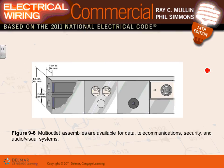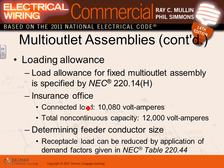If you don't know, always assume they're simultaneously used and give every 1 foot 180 volt-amps. Like I said, guys, separation is very important: separate the high voltage from the low voltage section in your multi-outlet assembly. Loading, we talked about the loading, guys. The loading is basically 180 volt-amps for multi-outlet assembly: if simultaneously used, for every 1 foot; every 5 feet, 180 if not simultaneously used.